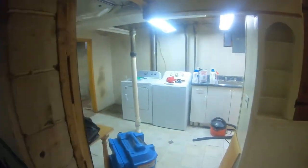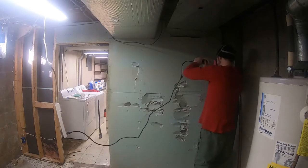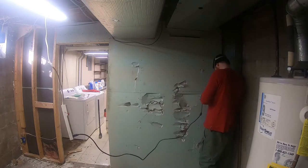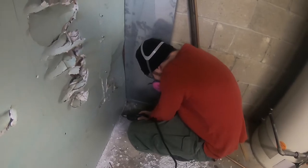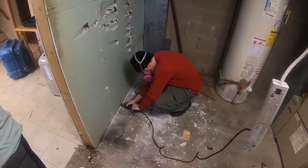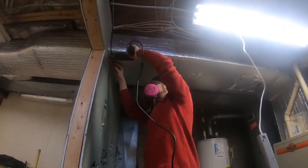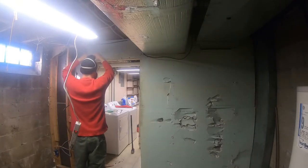When I first got there, I realized I was there a couple hours late. My brother already did a number on the big room in the basement, and there was only a little bit left. But that didn't stop me from being enthusiastic about doing some more demo work. It was a mixture of screws and nails that made it kind of difficult to pull off this drywall. Some of the drywall was replaced, and some was the original. So I spent some time pulling out screws in different locations. A lot of the screws had glue on top of them, making it more difficult to get the Phillips head inside. There were way too many screws — more than necessary.